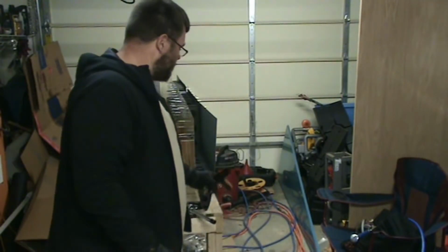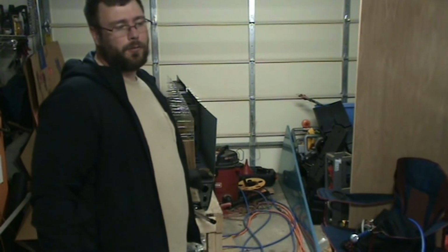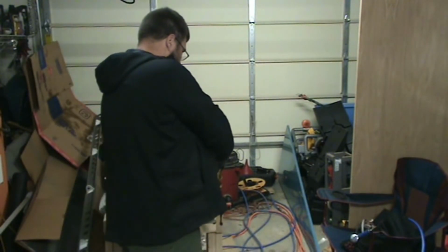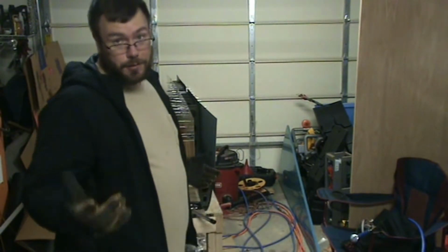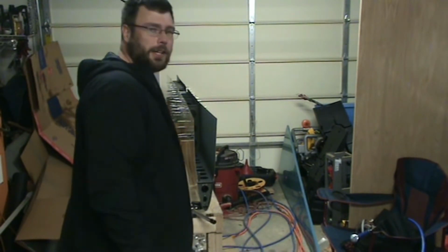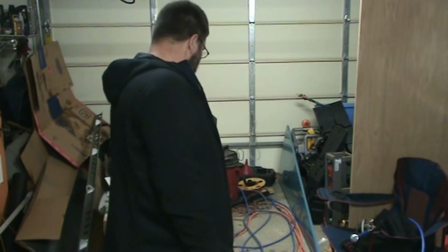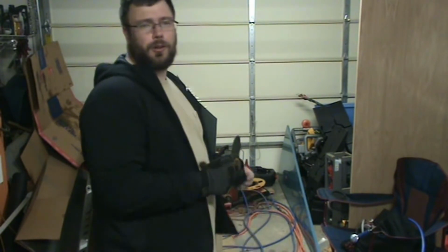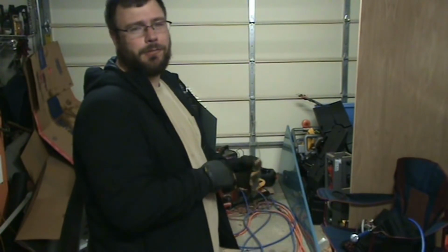Perfect. So on these 4-4s in the tip nose spars, to go from the thin material to the thick, you just use a squeezer. Sometimes the answer is right there, you just gotta look at it from a different angle. And my squeezer is kind of too short for the arms, so that was one reason I've been pretty much bucking every rivet, and I kind of forgot about the squeezer.